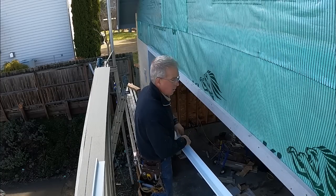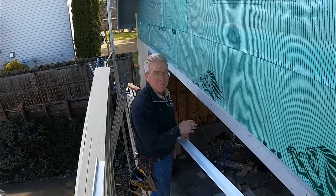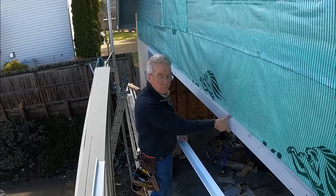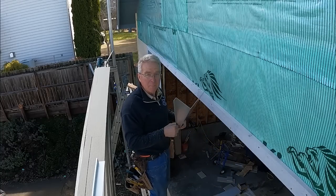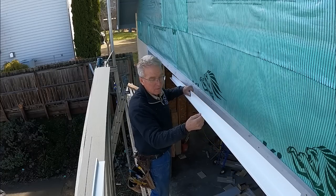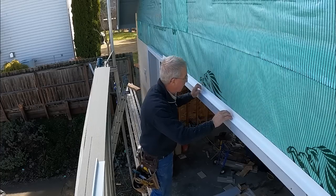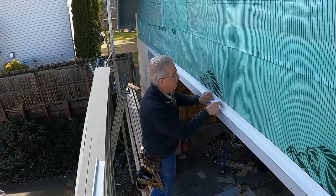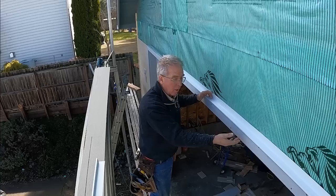I've come up the side until the next piece has to be fit horizontally around the top of this piece of trim. The trim is an inch and a half by about three and a quarter, matching what's on the adjacent house. This is a drip cap — not exactly a drip edge, which has a little tip out at the bottom so drips fall free. This is just a cap: an inch and a half out, about three-eighths to five-sixteenths down, two inches up, so that water coming down here does not immediately soak into the top of this spruce board.